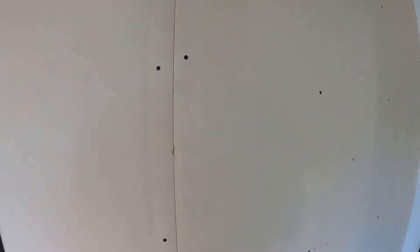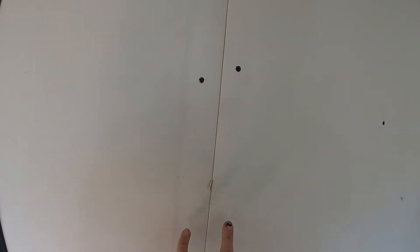You want to just sink the screws in ever so slightly so you see that outer fabric just curving in — like gravitational lensing — just around the circumference of the screw. Also, for drywall panels coming together, you want those tapered ends joining to make your jointing a lot easier.